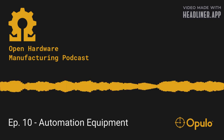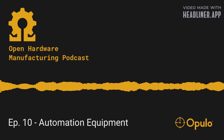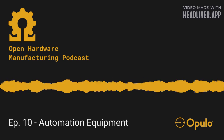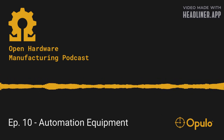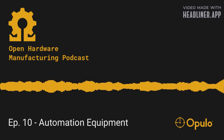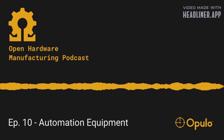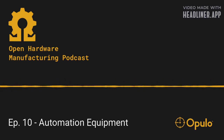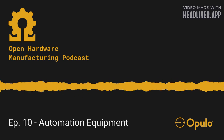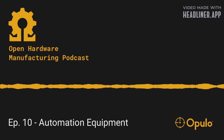To reduce the barriers to entry for testing the quality of the motherboard, we had to make this Pogo pin jig — to make it so anyone could do it. I think of it as offloading my logic into a machine. The lookup table in the MoBo Pogo jig that checks how all these things are connected was put there by me. That was my logic, now instilled in a little worker bee in the jig. Anyone can just borrow that little section of my brain. If you notice something requires engineering thinking behind it, that's a great opportunity to automate.